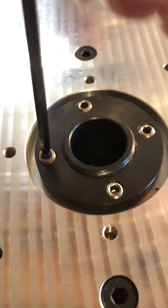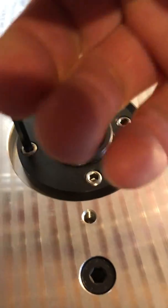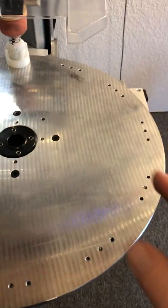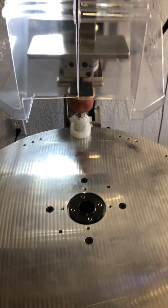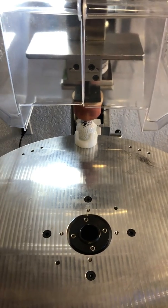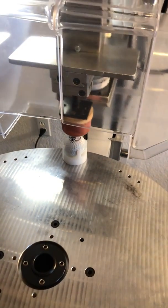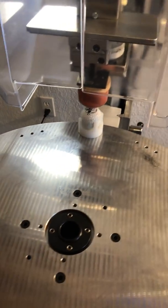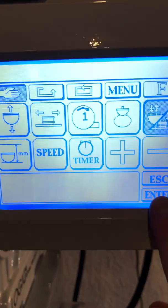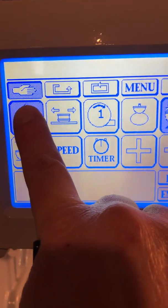Again, this is for the TOSH TRCN2S. This is the 490 millimeter diameter dial, which is intended for the Micro 90 with 1 or 2 90 millimeter ink cups and 100 by 200 millimeter clichés. So that's how you adjust the angle. Once I got that, I think I'm good. I'm going to hit enter and just back this guy up out of the way.